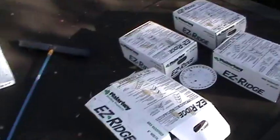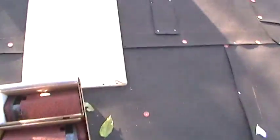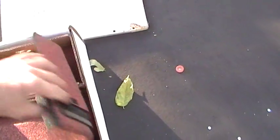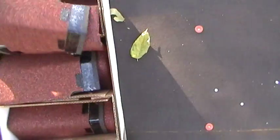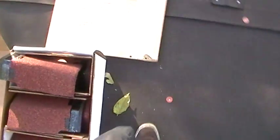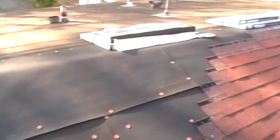I just discovered they gave me the wrong type of ridge cap pieces. I don't have the severe kind of a roof peak like the letter A, and that's what they sent me. I wanted something that was a little bit flatter with more coverage — like a 10-inch flapper. This is for a sharp A-frame like a log cabin or something. I might be able to flatten it out and use it, but if not I'll have to cut up shingles and make my own.